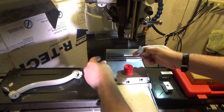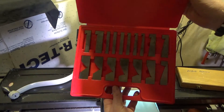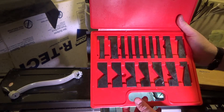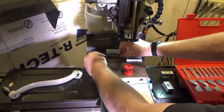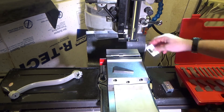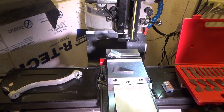This is where the new tool comes in. Out with the previous angle block - still very useful - and in with the new set. Here's my new set. These are all the same sort of angle blocks except they have a 90-degree flat machined on each one of them, so you can push a part flush up against it and locate against it. Here's a 25-degree block - let's orient it and grab our magnet. Put the part in and it lines up with the stop. If you take the part out and want to put it back, line it up against the stop flush, make sure there are no chips in the way, tighten it down, and you're good to go again - repeatably.